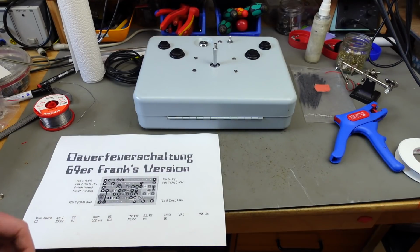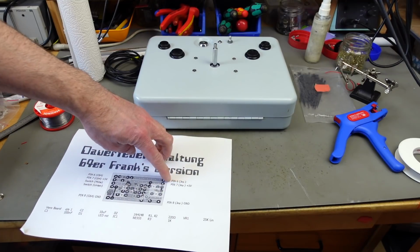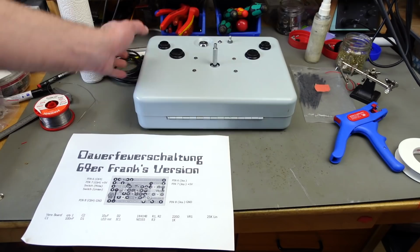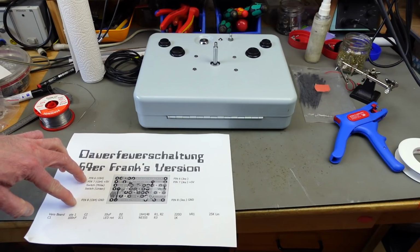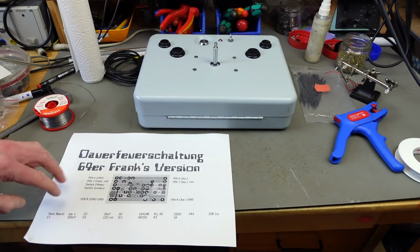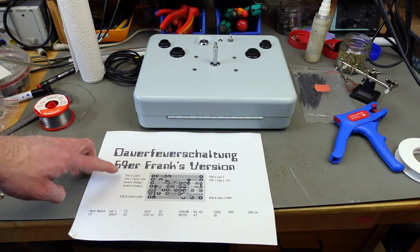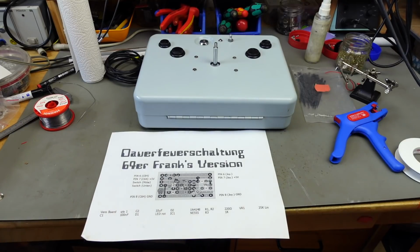Now what remains to be done is to wire this up internally. We are going to connect pin 6, which is the pin for fire on the joystick, and pin 8, which is ground on the joystick. This side of our little circuit board we're going to wire up to our actual contacts on the joystick assembly, and we are going to wire this side up to the side with our connector. This is going to be the side on the computer. And we basically need to wire up an extra for pin 6 because there's a resistor in there, and otherwise our Autofire is not going to be transported to the computer, which would be a bummer. So that's basically how I'm going to do it. Let's see what I come up with.